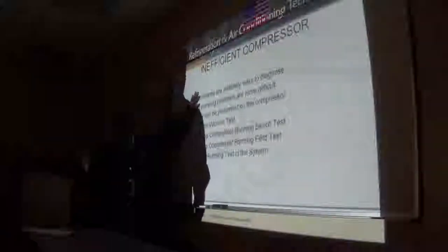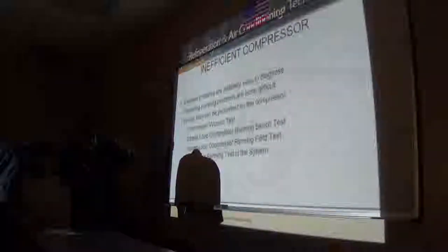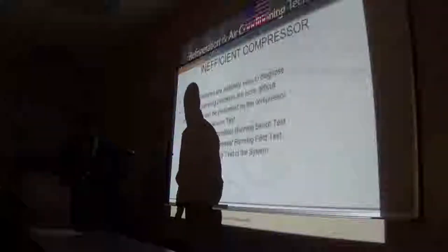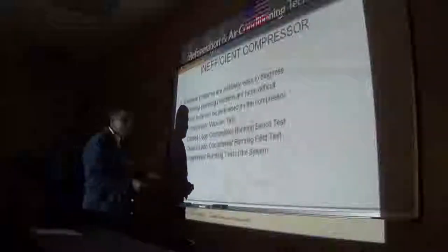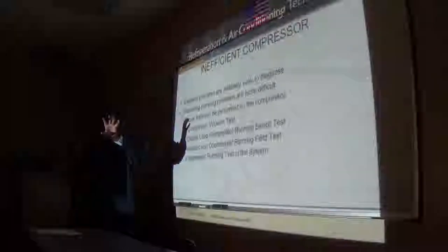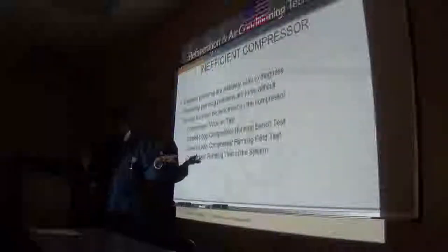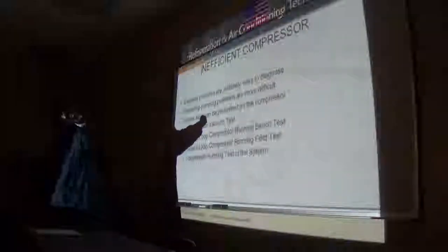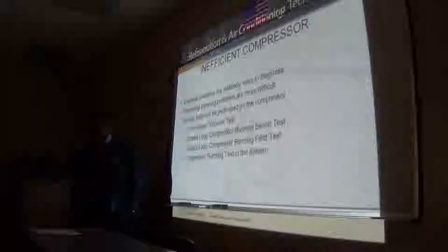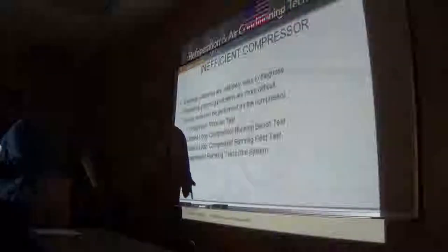You see, with a compressor electrical problem, you can find out why a compressor is tripping on overload. For example, I will have a compressor, and normally they have a little cover over the relay overload assembly. There are times when it's tripping and you take off the cover to check if anything jumps out at you visually, and the compressor stays running. The moment you put the cover back on, it trips. Can you figure out what really is going on there? Something's getting too hot.